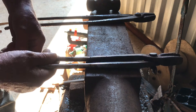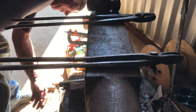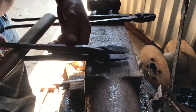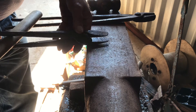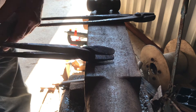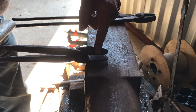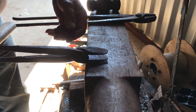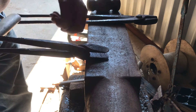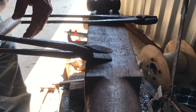The jaw and the handle are sort of cranked so you've got a gap in the middle. You can set the handles when you come to set the jaws to size, and to do that you need a piece of something — it doesn't matter what. There's a broken handle off something to put in between the handles, otherwise your handles will just close up and they will be touching by the time you've sized your jaws. Put your size piece in — something to keep your handles apart.